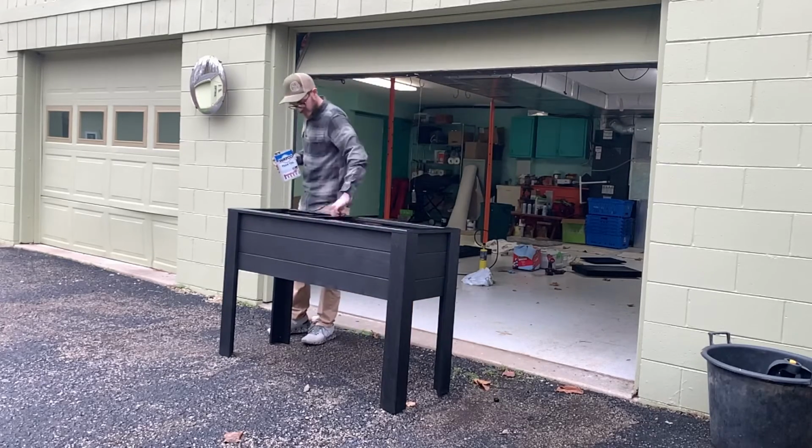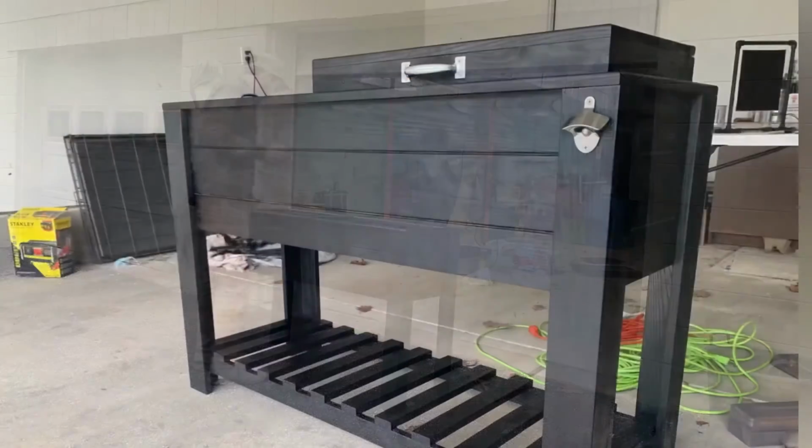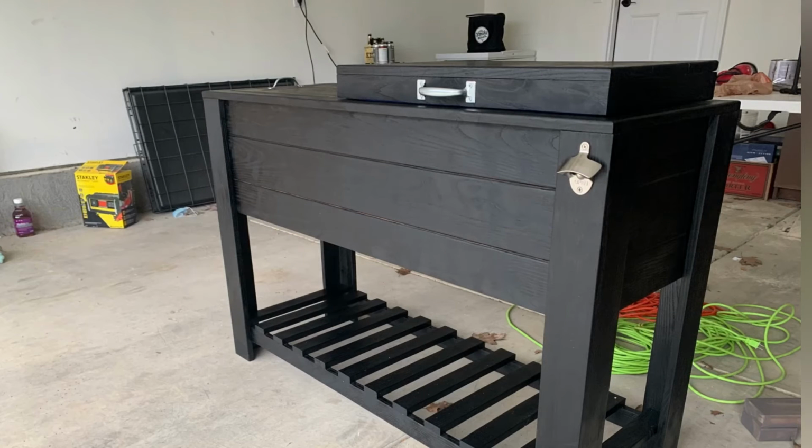oil. It's the teak oil plus the burn finish that I believe really adds the weather resistance. Burning the wood makes the wood very thirsty and dry, so I put on as many layers of teak oil as the wood would soak up. And there we are, a very nice final finish. Very happy with the way this project turned out. I think it looks very sharp. I learned a lot, a whole new finish that I need to keep working on and mastering.